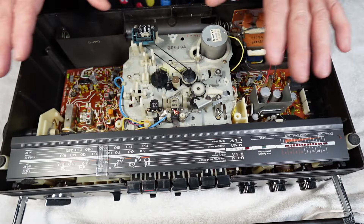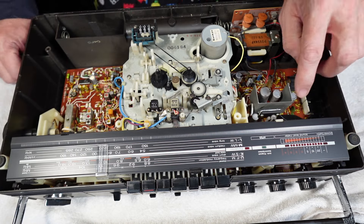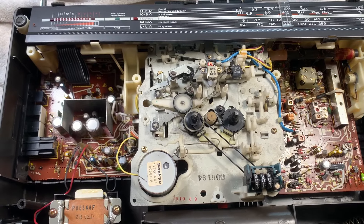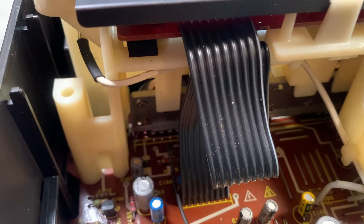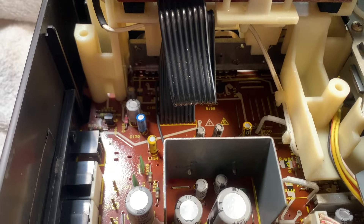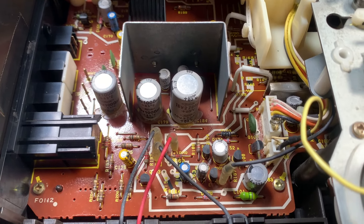With the front case off, we've got the dial gauge across the top and the condenser mics out to the side. Over here we've got the power amp board — we can make out the rear of the potentiometers for the volume, tone, and balance. We've got the power amp section plus the connectors for various inputs and outputs off the board. The power transformer also comes in here — this is where we supply auxiliary power to the board.